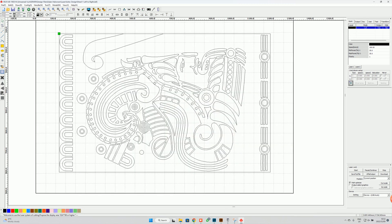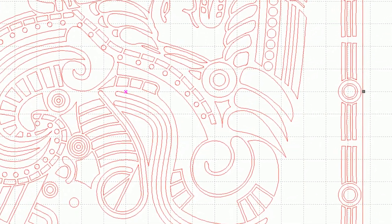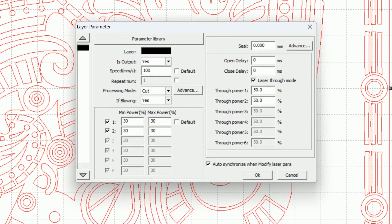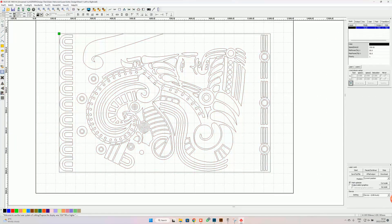Now that we've got two layers there, we're going to select everything from the inside of this border. We change it — output is yes — and we're going to say scan because we need to engrave. We're going to do this at a speed of 330 with a power of 50 percent, and we're going to leave it at 0.01 intervals, then push OK.